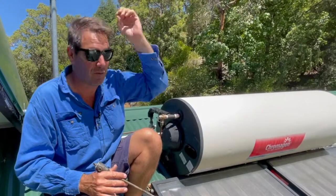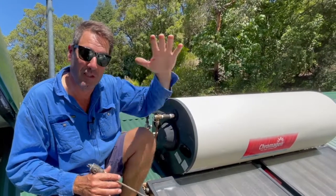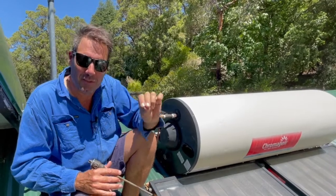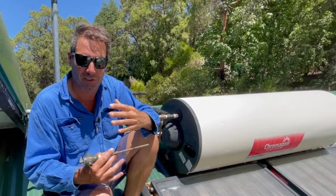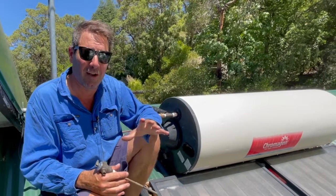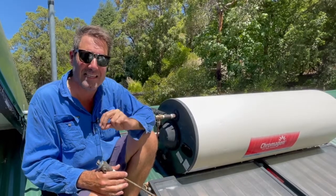And that's why it'll just be dumping water, water, water, until that temperature goes down a bit, back to 80 or something. Then it will start to shut off and go back to the pressure side of things. So it's quite normal, especially like today — it's 40 degrees up here, it's stinking hot. The water can get up to 100 degrees really easily.